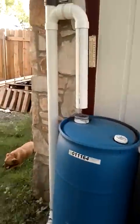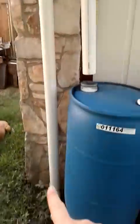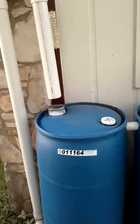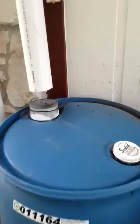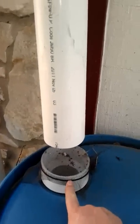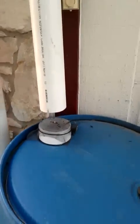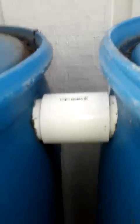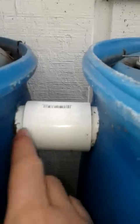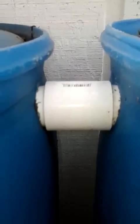So you've seen my other previous rain barrels — these are the first ones. I got the overflow which has the roof washer on it. But as you can see here, I've been working on this where you have to drill the top and put a little netting on there so it's an open system all the way. Then I went ahead and drilled holes here so that I could have an overflow in between with a little coupling in the center.